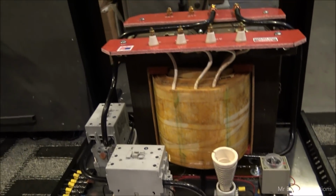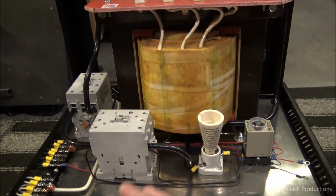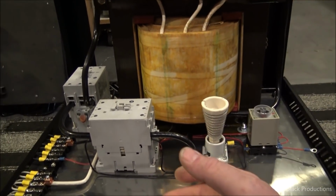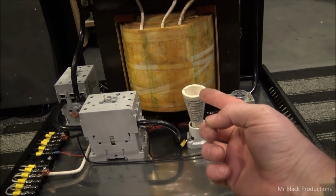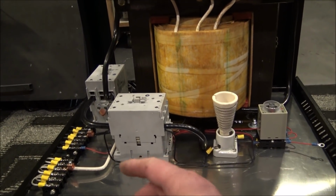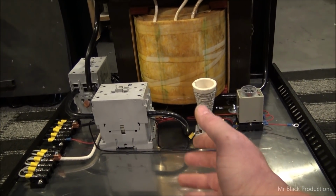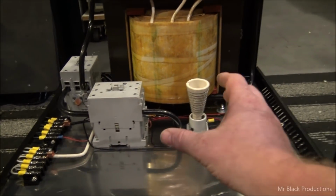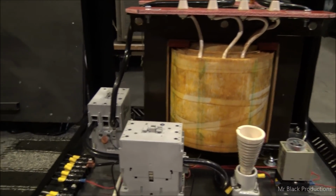We're going to do a full wave rectifier on this deal, okay? And the amount of amperage output on this transformer is a tremendous amount of power. So we have to control our electron flow into the core, which in turn will control the electron flow out of the core into the rectifier pack, turning it into DC, and then running it across a filtration circuit, which is going to be our oil-filled can, which is going to sit somewhere probably in here.